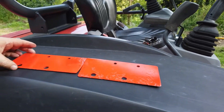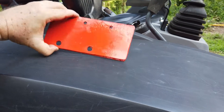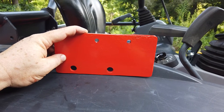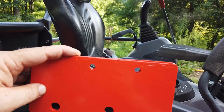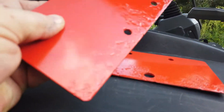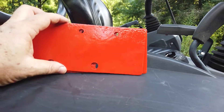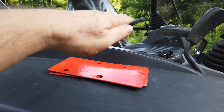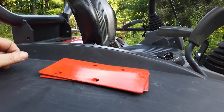This was one piece of metal - I cut it in half with the chop saw, stacked them, marked my holes, used a piece of paper, punched the holes through with a pencil, stacked them together and drilled each hole at the same time. Rechecked it, marked the other two holes, then put it on the grinder - there was some rust and pitting but I really don't care, it's just to hold things there. I was also thinking about later making some type of a guard to protect that diverter valve a little bit, but that can wait.